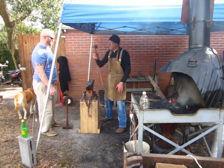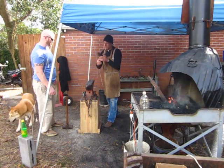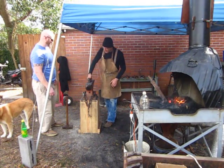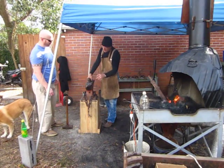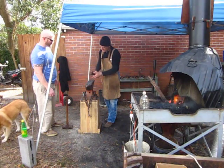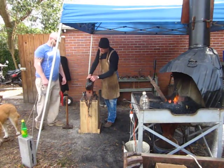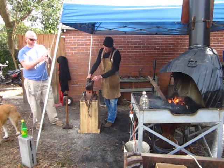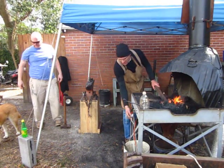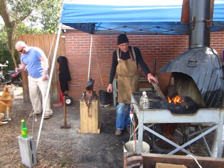But I read somewhere that if you're using a striker, you want to have 1 inch of wood sticking out of the tool. I understood the concept, but the reason is because you can always see it's on there. If it were simply wedged in there, you're not really sure if this thing starts rotating outwards. I want to know it. As long as I see wood, I know that tool is handled. Because you can imagine if it came loose for some reason, it would shoot off like a bullet.